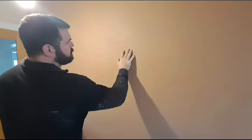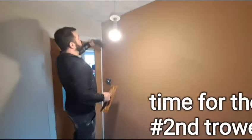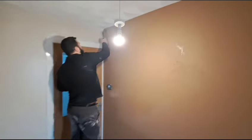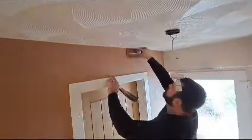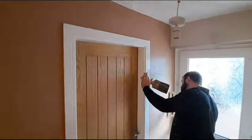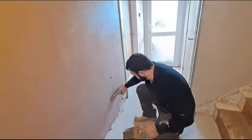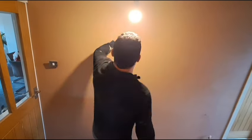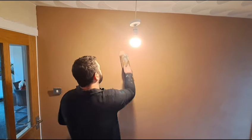What I'm checking for now is I don't want any plaster sticking to my fingers whatsoever — it should be nice and firm. It was still a bit wet, so time for a nice cup of tea. Now it's time for the second trowel. You can use a bit of water on this trowel — feel free to flick a bit on the wall or brush it. I prefer to flick it; saves me having to keep dipping my brush and getting it covered in plaster. Same as before, working over the whole area in a nice methodical way. Be careful around the switches and crack on as you did with the first and second coat. Keep checking the wall — it should be almost set, and you can hardly make any marks in it now. It's really firm.